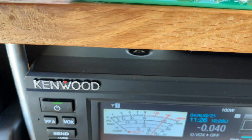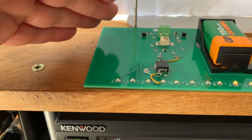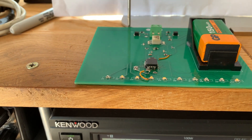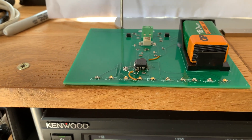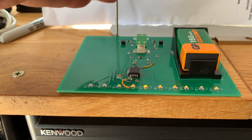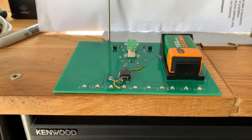That's 100 watts. Now, I just want to show you something. Here's my hand — my hand is going in and out near the antenna of the meter. And as you can see, it's affecting the EMF around the meter. That shows just how complicated having an accurate measurement of an EMF field is around an antenna, because there are so many contributing factors. Good luck for anybody who tries getting an accurate reading. Thanks for watching.